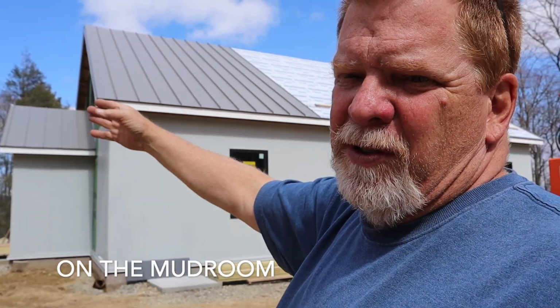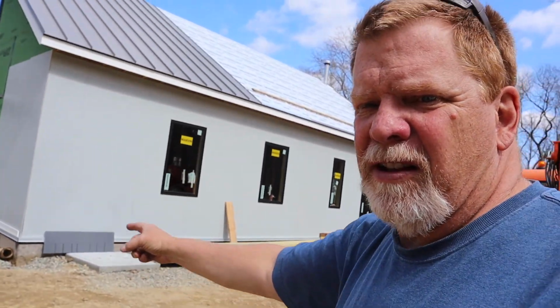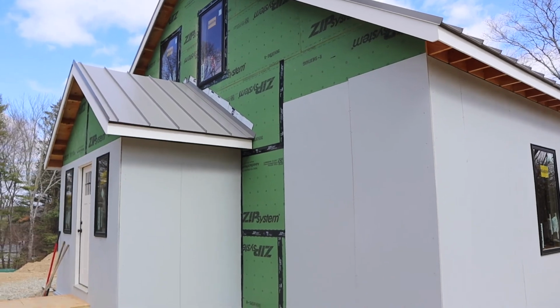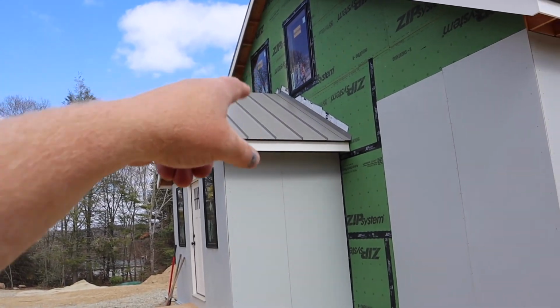So, you know, we have a 4-inch piece and a 16-inch piece. That might be better if it was 10 and 10, but we wanted the widest piece possible against the house up here, so that we didn't want a lot of ice building up against the house. So we made a small little narrow piece out here on this end and a wider piece there.